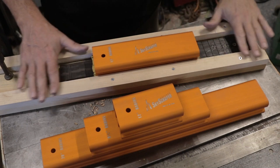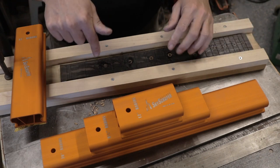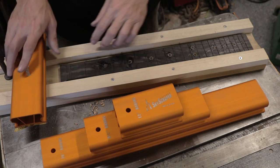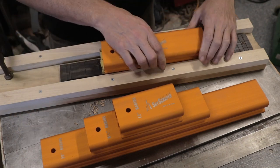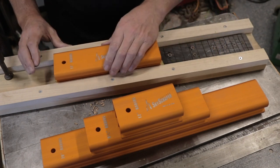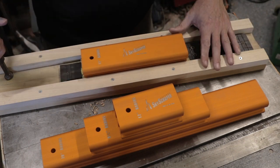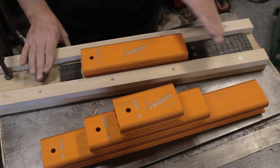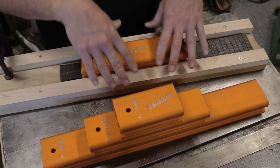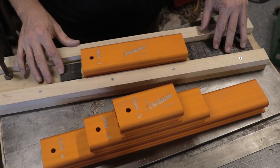We have our radius sanding jig set up here — I've got a separate video on how to make this and I'll link it in the description. It basically has a flat and parallel base with two sides that keep the sanding block from moving side to side, so there's zero movement and we're sanding in a very flat orientation all the way through. It's clamped down to my table saw, so if any bow gets introduced into the jig over time, that bow gets taken out and the flat reference surface of the table saw translates its way up through all the pieces and parts.